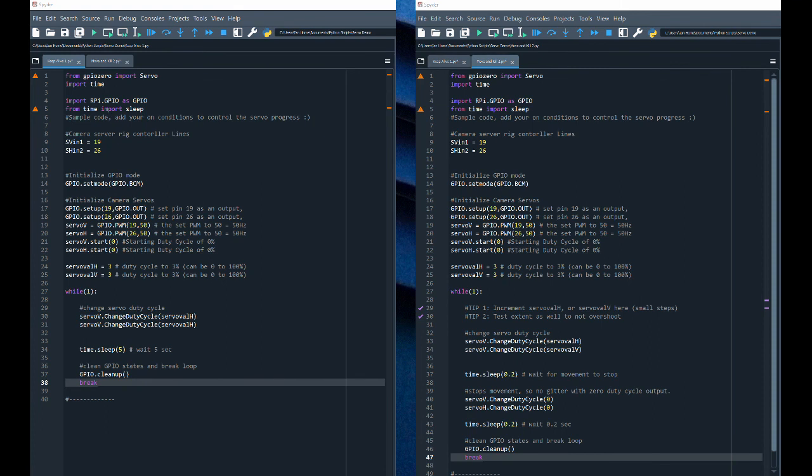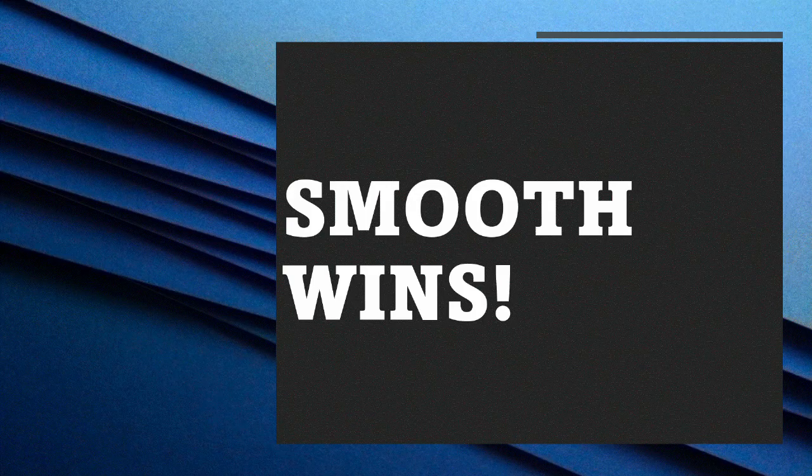You'll notice that the main difference is at the end. For the keep-it-live version we can directly set the destination in the arc. In the move-and-kill version we need to increment the arc to its desired value and test its extent every time we move, returning the duty cycle to zero between moves so that the position is held. The reason for the small increments is to minimize the chance for jitter to creep into the system while it's active. Simple enough.